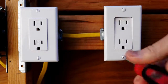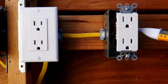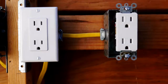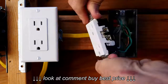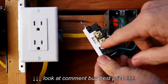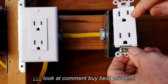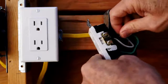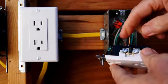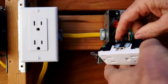The first thing I'm going to do is remove this wall plate and receptacle. With the receptacle loosened up, I'm going to double check and make sure that there are no hot wires at all in this box. Now let's examine the receptacle. We have the white neutral wire going to the bronze colored terminal — that's incorrect. The hot black wire must go to the short hot terminal side with the bronze colored terminals. On this side we have the black hot wire going to the silver terminals, which is the side with the long neutral slot. So this is incorrect.